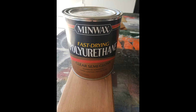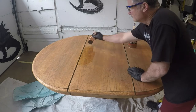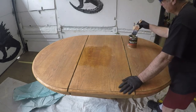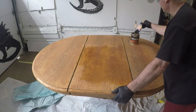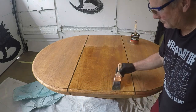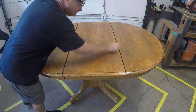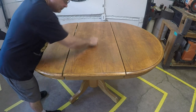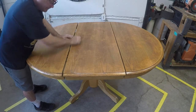After the stain has dried, you want to apply at least three coats of fast-drying polyurethane. You may be tempted to take a shortcut and try special triple-thickness polyurethane — don't do it, this stuff is useless. Use the stir stick to gently mix the polyurethane before each application. Use a nice brush, go with the grain, and try not to create air bubbles as you're applying it. Start from the middle and work your way out, so that you're not leaning over freshly applied polyurethane — you want nothing to land in that, like your shirt tail. In between each application, after the polyurethane has dried, gently run across it with some fine steel wool. This gets rid of all the little air pockets and imperfections, and prepares the table for the next coating.